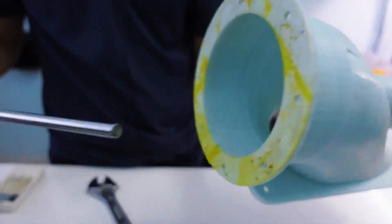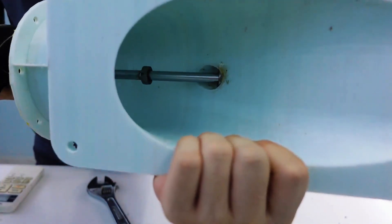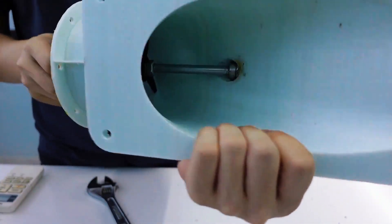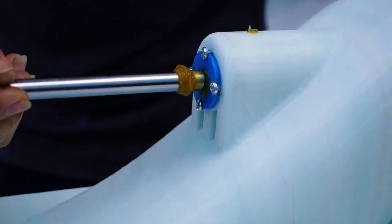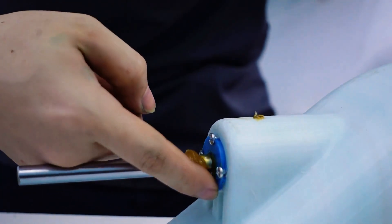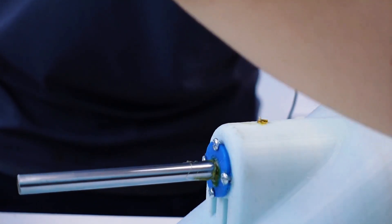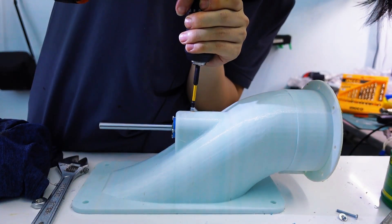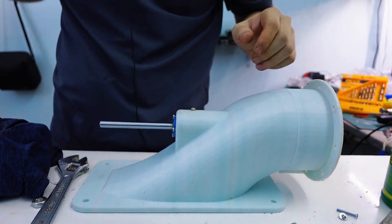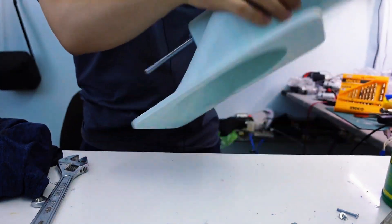Next I'm going to install the fan blade, but before that I'm applying some lubricant. This one works really well for reducing friction and making assembly smoother, and it helps protect the shaft and threads during high speed operation. It has a fairly high viscosity — that thickness helps create a strong barrier, which is really useful for preventing water from seeping into the engine chamber along the shaft. It does a great job at both lubricating and sealing, very handy for builds where water resistance is critical.